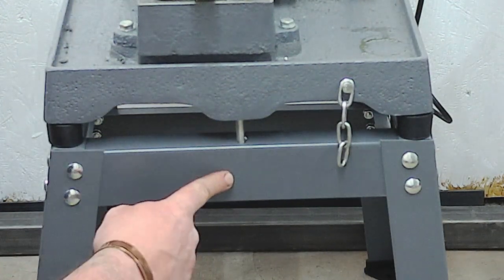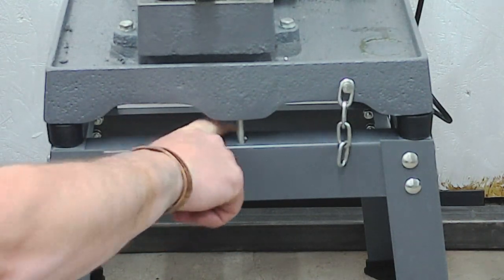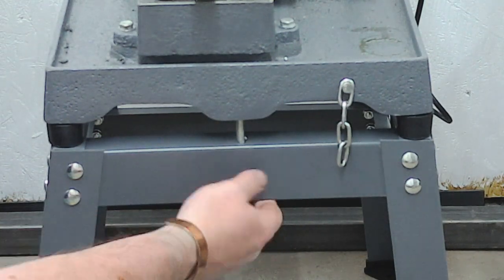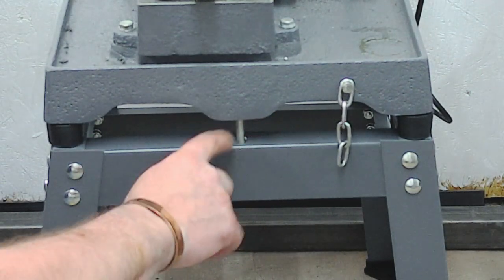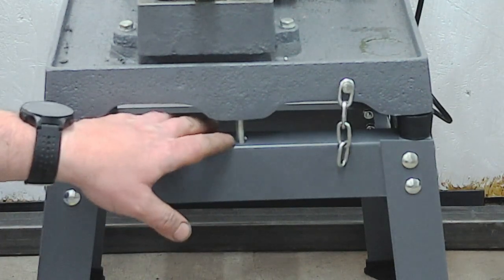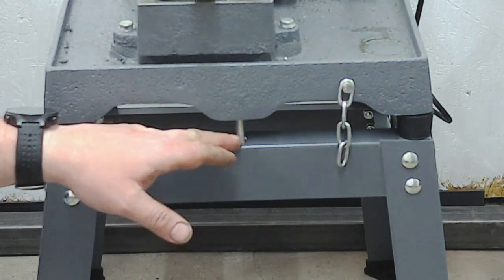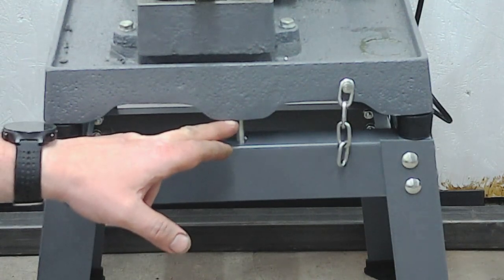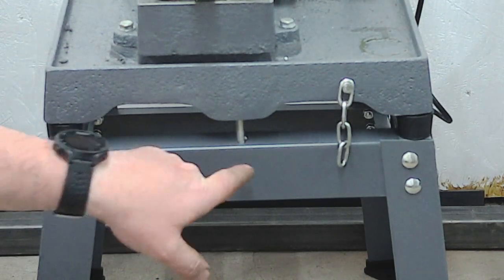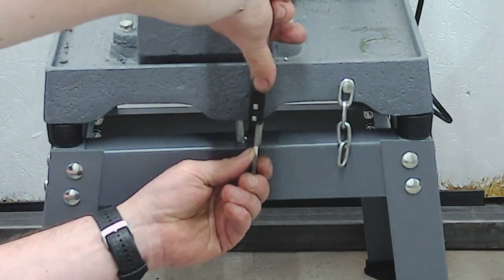So the problem we've got here, when you're bolting up from the frame into the bottom of the casting, is this frame's only, I don't know, 3/4 mm thick. So if you tighten that with any force, all you're going to do is distort this sheet metal framework. So all I did when I built the saw was give it a slight nip. So the plan now is to make two spacers. There's one of these bolts at the front and one at the back, the same in the middle. So I'm going to make two spacers that sit in between there and the casting, which means I can tighten that right up, nice and firm and rigid. It's not going to go anywhere, but it's also not going to distort the thin sheet metalwork. So we'll just have a quick measure, see what sort of distance we're talking about.